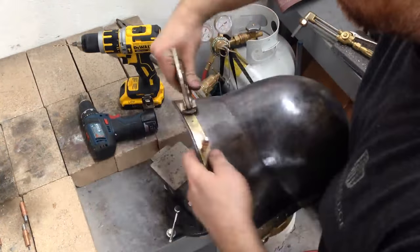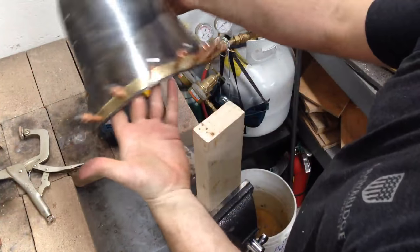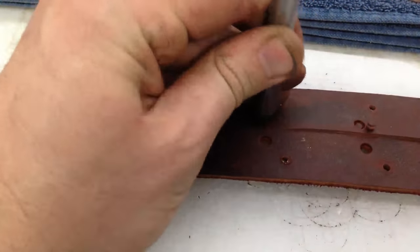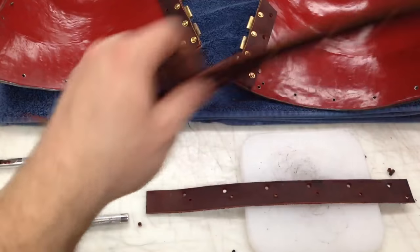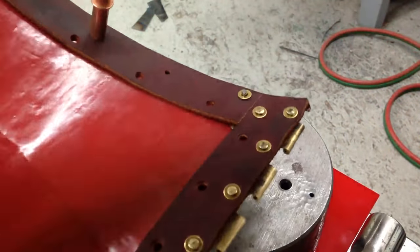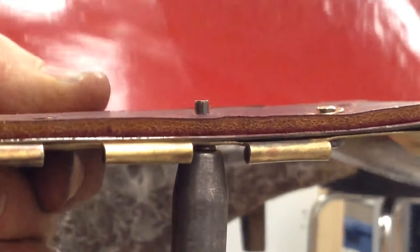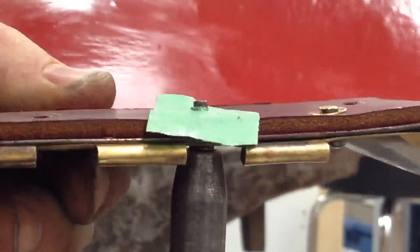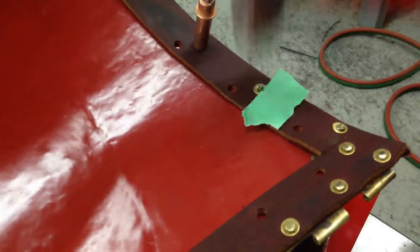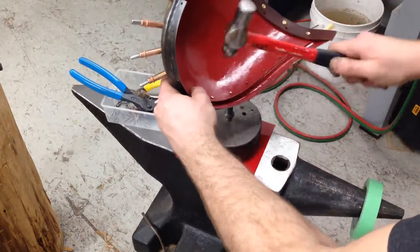It's a little bit tedious but it's actually quite fun to assemble this kind of stuff. You just work your way around starting at one end, keeping the brass nice and flush as you work your way to the back. I'm punching some holes in some strips of latigo leather that will get installed around the bottom perimeter of the helmet. I've left some holes that don't get riveted — those are for attaching a removable liner if I ever decide to make one for this helm. These are brass rivets and they're kind of a grey colour because I've aged them with a patina before I rivet them. It's often easier to just age a bucket of the rivets in a small amount of patina and then polish it off once they've been installed — so they look grey when they go on and then they polish down to a brass colour again.